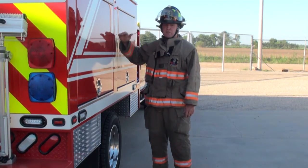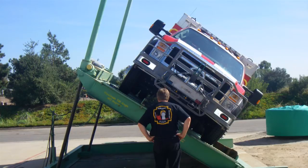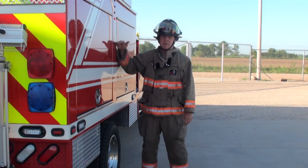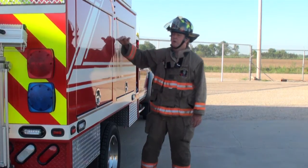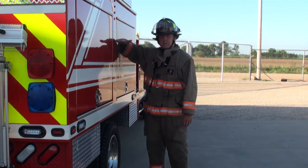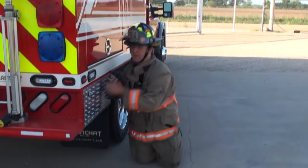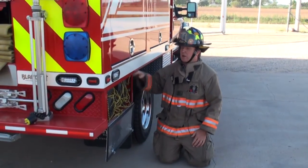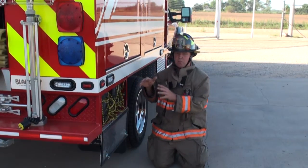Another key thing in construction is your center of gravity. We're holding the record on our tip table. This truck is registered at 37.2 degrees and broke over at 39.3 degrees. To get stability and keep our CG low, here's the top of our water — this truck carries 400 gallons. Our heavier items like cribbing and the gen set are stored down low, keeping the major weight low.